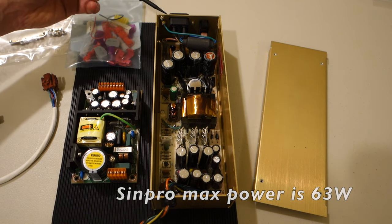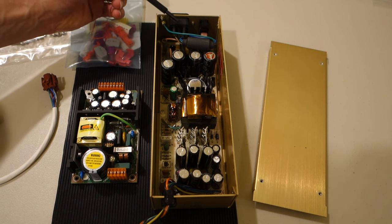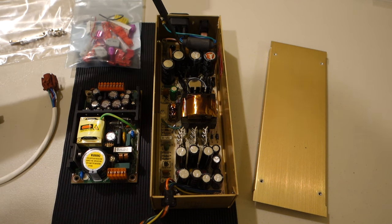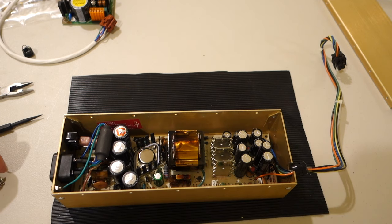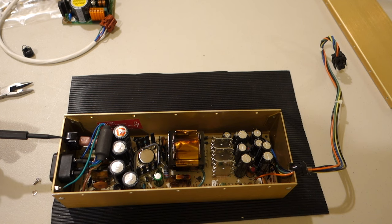So we'll go ahead and disconnect these wires from the AC input and from the switch, and then break the sealed screws here, void our warranty, and see about mounting this. Another point, when you're removing the screws that hold down the power supply, just be careful because each of the screws also has a washer on it, and you don't want to leave any of those washers behind in the case where they could actually end up touching any of the components on the new power supply.